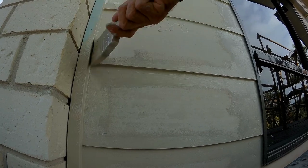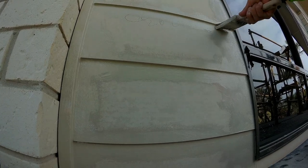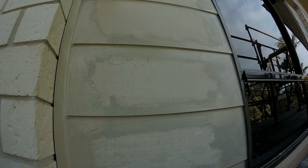It's very important to get that bottom edge. If you spray this, you won't get it. All you do is blur it up — make it look like you've got paint on there, but it hasn't. If somebody says to me, 'Oh, why don't you spray it?' — well, you need to think about what I just said. This way here, I'd definitely get a coat. I've got a good, solid coat underneath that bottom edge.